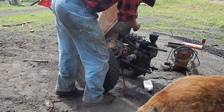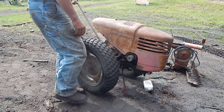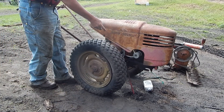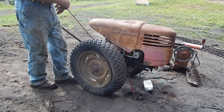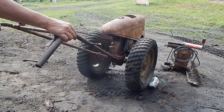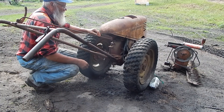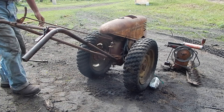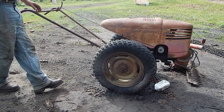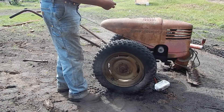When this hood is down you have this pulley that's exposed, so you can run power to anything. They've got a kind of a kickstand — if you don't have an implement on the front you have to have the kickstand down or they tip over. They've got a drawbar arrangement here that you can hook stuff to, and things pin in there. Really it's a big transmission — and you hear that clicking? It's meant to drive via ratchets on the wheels, so when you make a corner one wheel has to free-turn. There's no differential; it's all done with the ratchets.